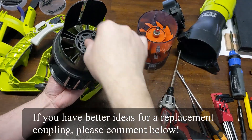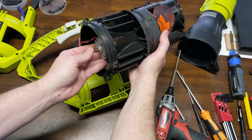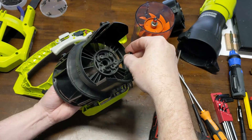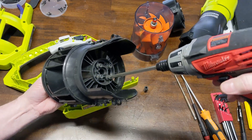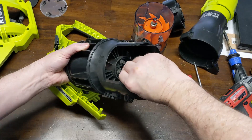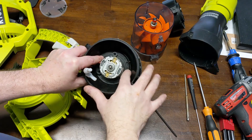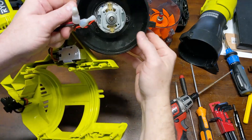Just have to get this started. Remember that the motor leads are going to go up, so other than that it doesn't really matter about the bolt pattern, but it may matter about your wire length. We want to make sure we pull these down evenly and snug — we need to pull the C-face of that motor up against that plastic, and we want the runout to be as true as we can on that coupling to the jet fan. We put these three screws back, but we've got to make sure we catch that key and that little notch before we put our screws in.